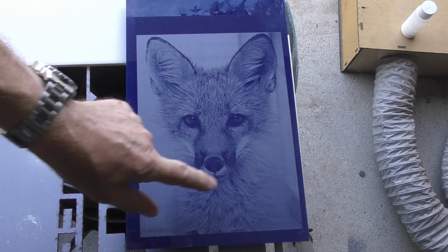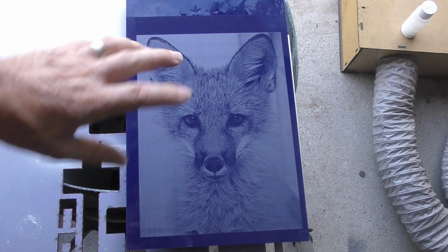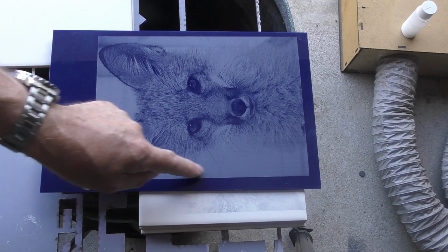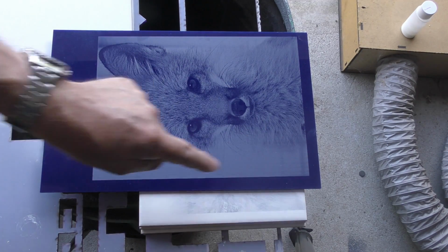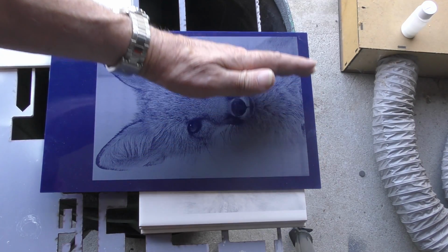I believe that we've got a problem here with something called aliasing, where the frequency is not matching the pixels that are in the picture. I could change the PWM frequency and get rid of these what appear to be aliasing patterns in the x-axis, and now we've got these aliasing patterns appearing in the y-axis.